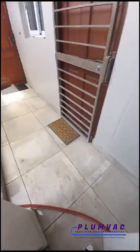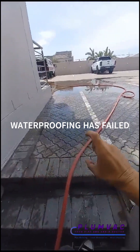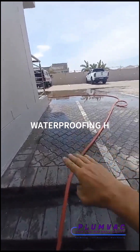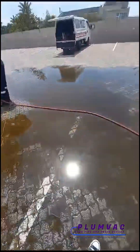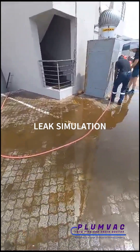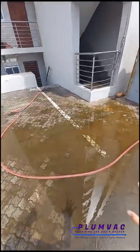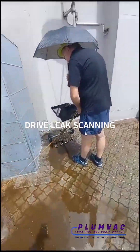We've now earthed it over here and we are now scanning the ground contents — the waterproofing on this entire slab. There's sand underneath the bricks and torch-on waterproofing which has failed. We've now wet this entire surface to activate the leak, and now we're scanning it with the MTA Roof Scan, which Andre is now doing.